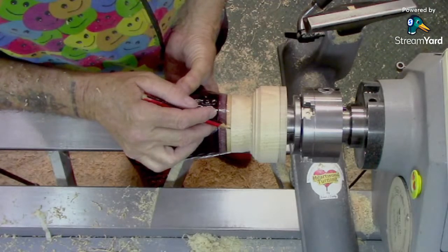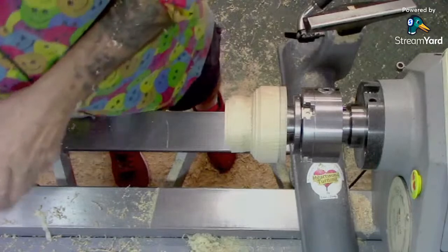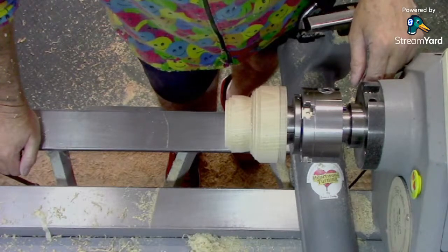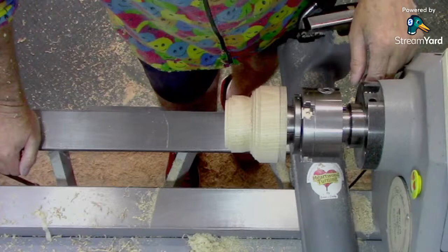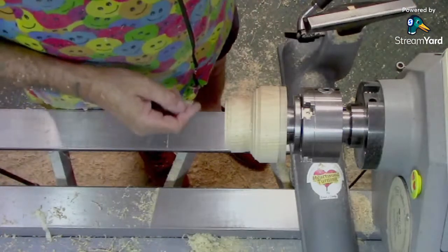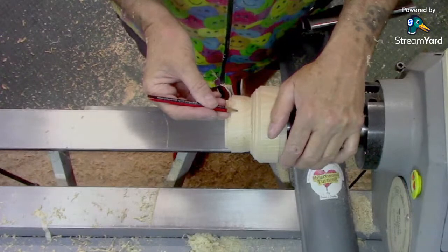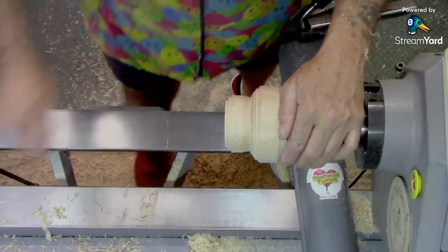And then put it on the mortise that you made on the inside. Cove out the top. Dish out the top. So you've got an inwards curve. Then you put your sanding disc on and you sand off both sides of that circle that you've cut. So you've got a square piece in the middle. So how much of a circle do you want here then? Leave that as exactly as it is. Don't touch that. Right. The bit behind that, towards the chuck. Square that edge. Square this edge off now.